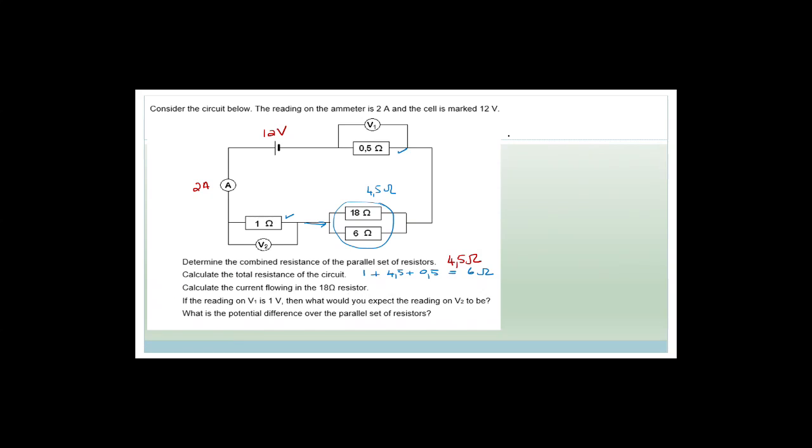Okay, so do you agree it comes along and splits up into my 18 ohms and the 6 ohms, right? There are 2 amperes coming through here. It splits up in a ratio of 18 to 6, but it's a reverse ratio, okay? In other words, more current goes through the smaller resistor, but the ratio is the ratio of the resistances.